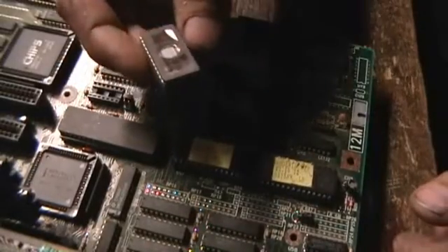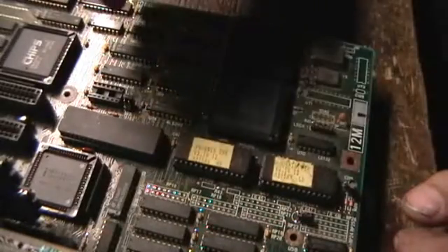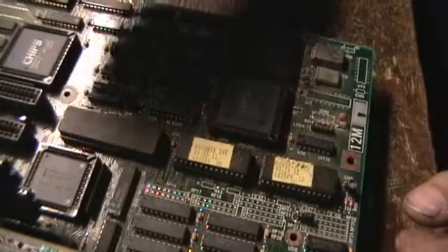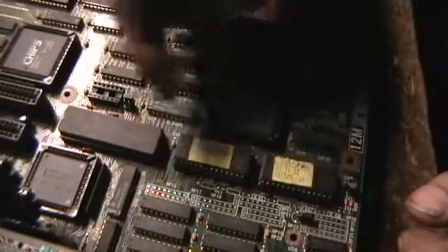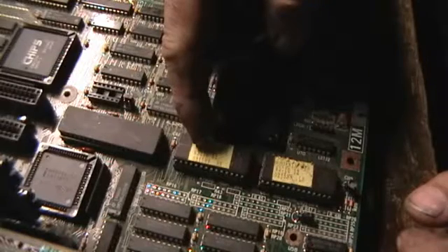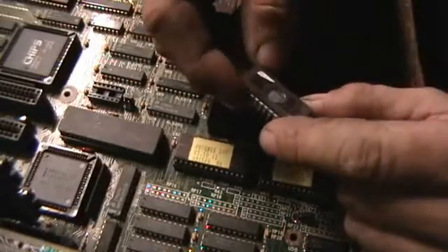As far as the BIOS itself and the two EPROMs, it's quick and easy to pull them off, get a good copy of the BIOS, reflash them, and that should extend the life of your older computer another 20 to 30 years, forgoing any other problems. One reason it's really easy and quick to do is you don't even have to erase the old EPROM to reflash or reburn it, because you're literally putting data back in verbatim, cell per cell, exactly what is already there. You're just reprogramming a one to a cell that already was a one, and a zero to a cell that already was a zero. So it shouldn't require any erasing — just put it in, read it, make sure it's a valid copy, reburn as is, and you should not have any issues.